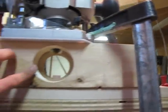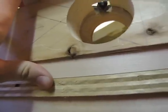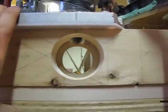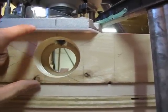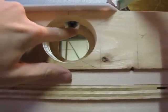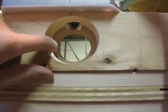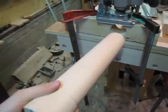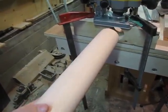After you clamp this block on, use your drill with that same bit and take off about three sixteenths of the nut so that the first thread here is cut halfway through. Here I have the dowel that will be made into my screw from my shoulder vise.